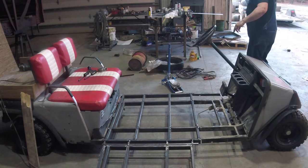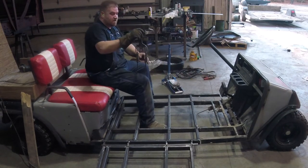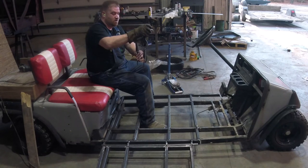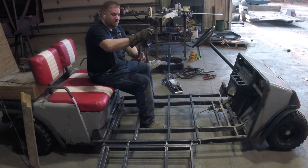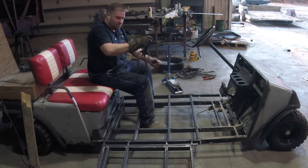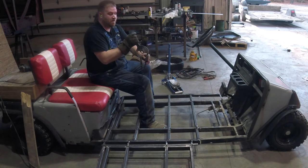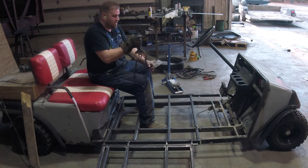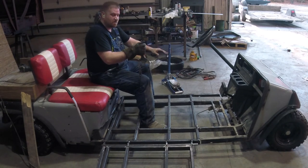So you'll be able to wheel up, come down, and this is what I have for the linkage. As I push this forward, this lever will pull this lever up. This one will then have the ability to just float free. This will pull up, turn a bell crank, and pull on the throttle. And then as you come down and release, and as you pull back, this lever will pull the brake back, and the throttle will be able to free swing here. And pulling the brake, again with a couple bell cranks, to lift up and then turn it to pull this up. The only thing I don't have right now is the lock to lock it in the parking brake.